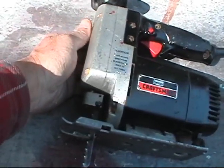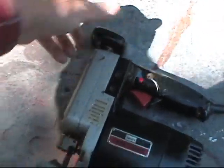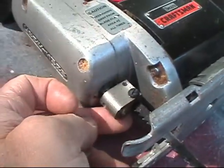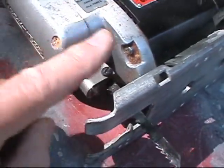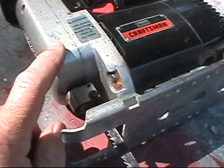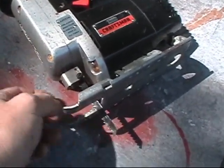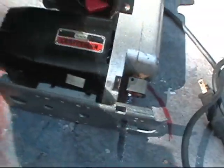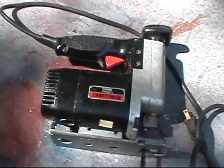This I did not get at a yard sale — I bought this about 25 years ago. It's a Craftsman scroll saw. One thing you have to look out for when you buy a used tool is make sure the bearing isn't worn. You just check for side-to-side motion — there should be a little up-and-down motion, in and out, that's fine. But if you get side-to-side lateral movement, that means the bearing is worn. I had one before this that was totally worn out, the bearing was all shot from a lot of usage. This one has a very, very slight side-to-side motion, but it served me well for many, many years. You can see the cord on this is a decent size too, and I never had any problem with it. It's a very good little saw.